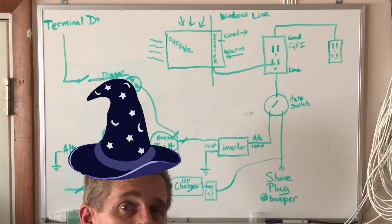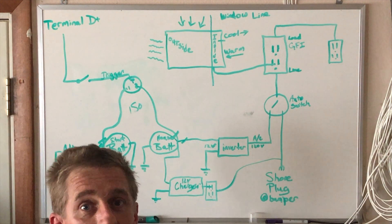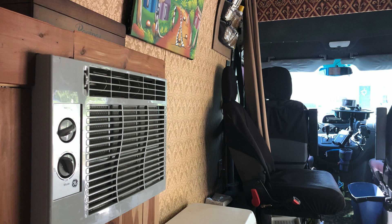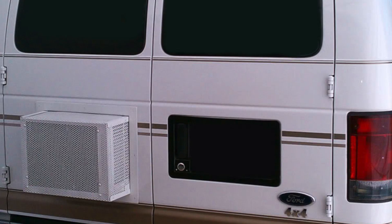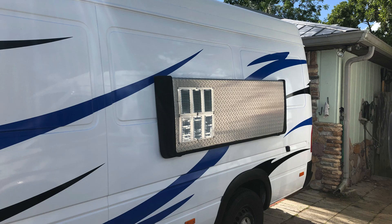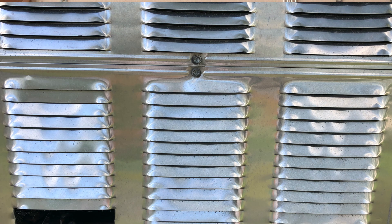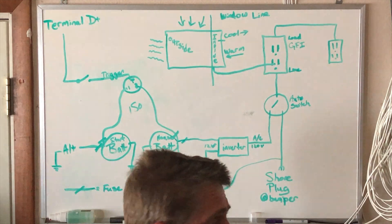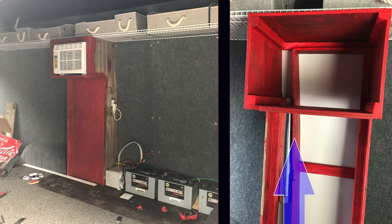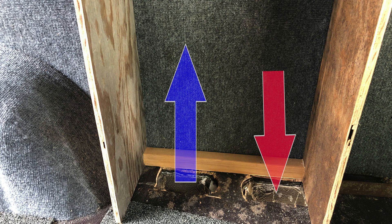Here are the basics of simple, affordable air conditioning that runs in your van whether you're parked or on the road. It's a window unit air conditioner built into the van creatively so it's vented outside — either through the back doors or holes in the floor. The blue saloon has a toolbox stuck in the side with the AC vented outside. The green solar van has a wood box and ducting so fresh air comes in from underneath, goes across the hot coils, and that heat is ducted back out through the underside of the van.